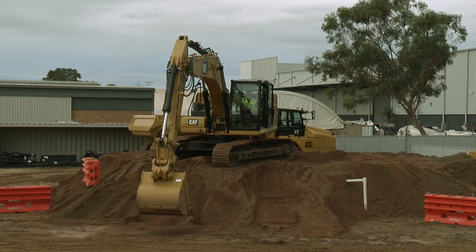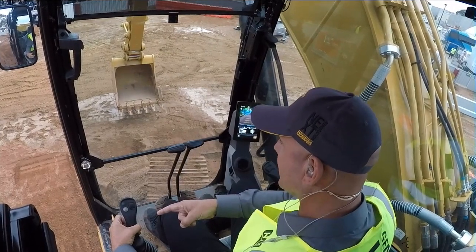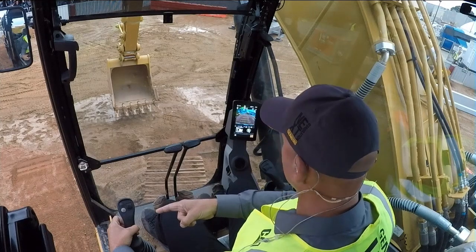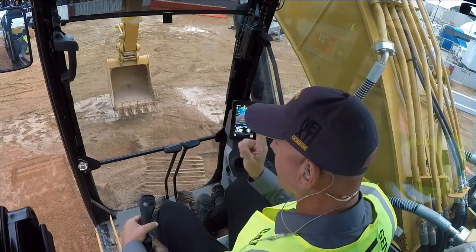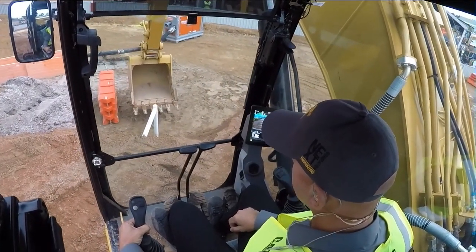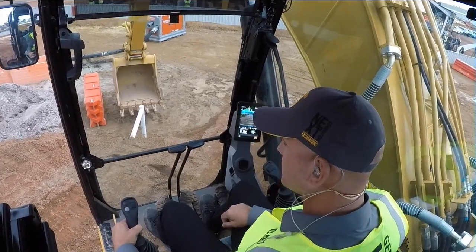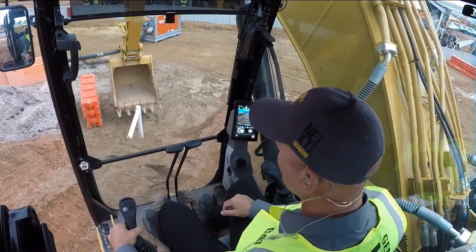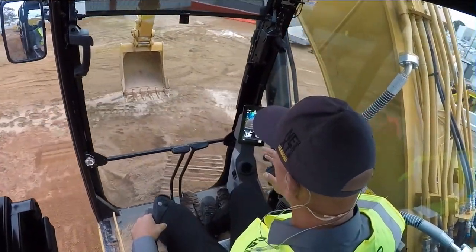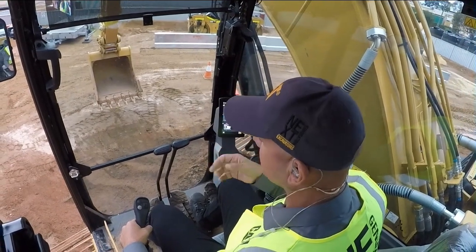It's stopped there. Hopefully you can see in the monitor that the left joystick is pulled as hard as I can to the left — I cannot go past it. But with swing assist, the minute I let go of that joystick, I can push past it. E-fence left — all the way — stops. Pulling as hard as I can, and even if I let go, I can't push past it. So e-fence is purely a safety feature, and the assist is there to assist the operator with shortcuts.